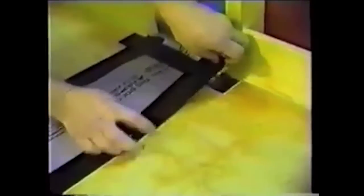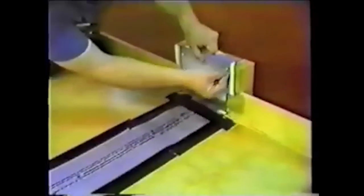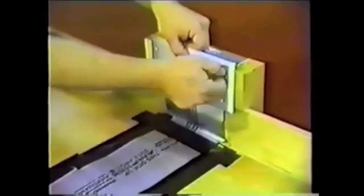Finally, install hold-down tape along both edges of the top shield, taping the top shield to the floor all the way to the wall. The termination block in the transition box is now ready to accept round wire termination. After round wire termination, the transition box cover can now be installed.